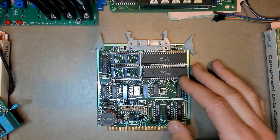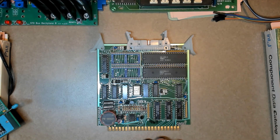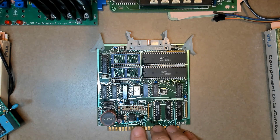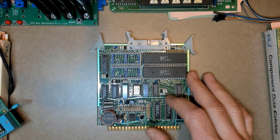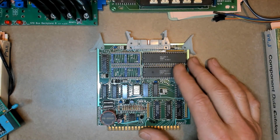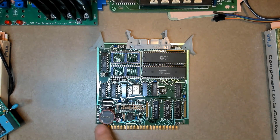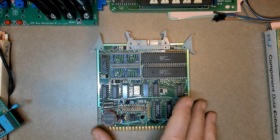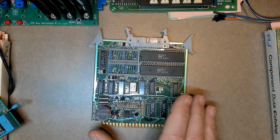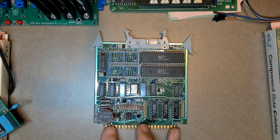I don't know if Onset originally designed this bus for the 8085, but I remember that the bus signals seemed a lot like the 8085 data sheet. It had a multiplexed address and data with the address latch enable — the ALE signal. At the time I was very much into the 8085, so that stuck with me. This is a CMOS 8085A. I'm not sure if Onset made other CPU cards, but this did have expanded addressing, maybe 20 bits or so — used more like memory paging rather than direct memory access, though perhaps they did use processors with native 20-bit addressing.